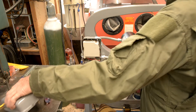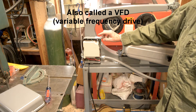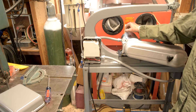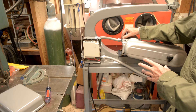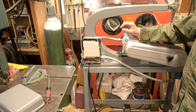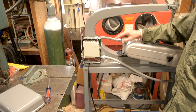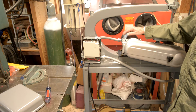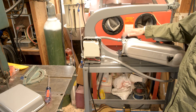Inside this box I put in this inverter — it's an Automation Direct GS1, like I said in the other video. Inverters are absolutely fantastic devices. This takes 120 volts and outputs three-phase 230 volts. This motor is rated 230, and that's programmable anywhere from 208 to 240 volts. I programmed it for 230 because that's the nameplate. It also has electronic motor overload protection — the motor is rated at one amp and I programmed this for one amp. The motor originally on this machine was rated six amps at 120 volts; this is one amp at 230 three-phase. When you do all the math, this is still a little bit more efficient.